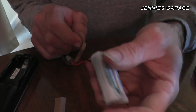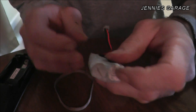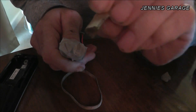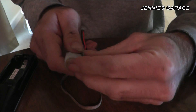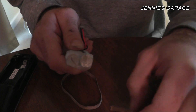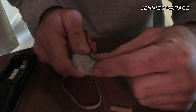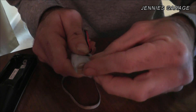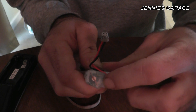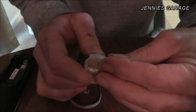Next, I'm going to install the rubber band onto the battery pack so that it holds these wires against the terminals of the batteries. For the negative side of the batteries, I'm going to place this small piece of cardboard on top of the wires because these connections are not very secure if I just put the rubber band over them, as there's no direct pressure on the tops of the wires. On the positive side, the rubber band will press directly on these wires and on the terminal because it's raised. On the negative side, the terminal isn't raised so I need to apply a little bit of extra pressure.